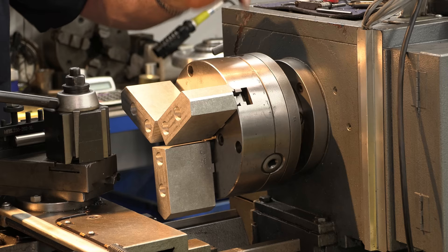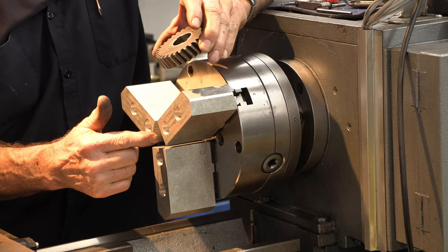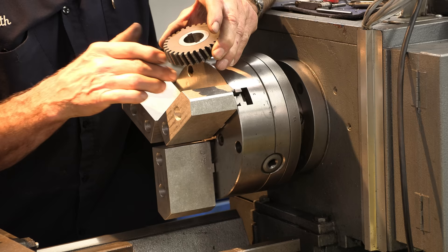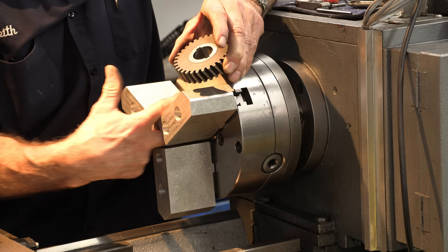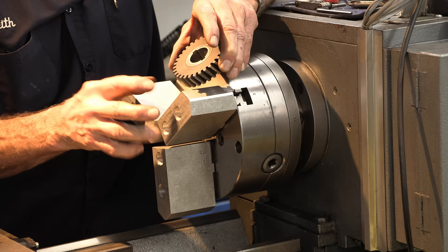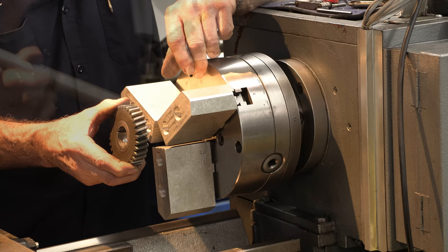That's pretty good for a closed position. Now we need to spider the jaws — meaning I need to put something inside, preferably on the inside jaw, the steel scroll section of the original jaws, because they stick out just a little bit from this surface. If I can get a diameter in there and clamp down on the jaws, we're going to be holding this in the closed position so the tension and scroll motion is in the tension direction. Then we'll be able to machine the aluminum part of our jaw to make the pocket to receive the gear.